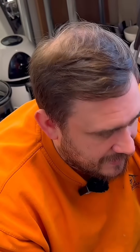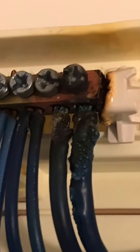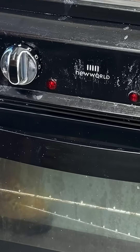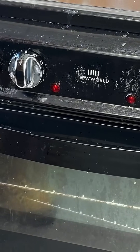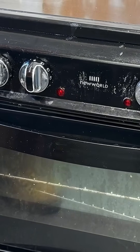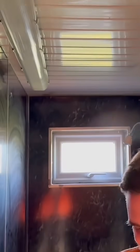I'm probably going to go C2 — potentially dangerous. That aligns with documents like the Code Breakers from Electrical Safety First, which talks about a plastic consumer unit with signs of thermal damage being recommended as a C2. Similar situation here — there are obvious signs of thermal damage — so probably going to go C2 for this one. We spoke to the customer and they're actually replacing this oven. The new oven's coming tomorrow and I'm going to connect it.